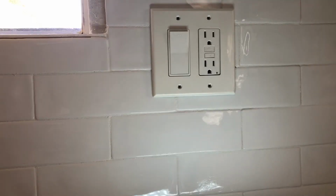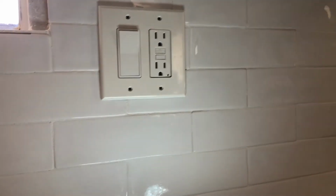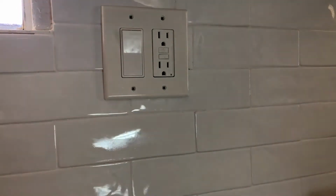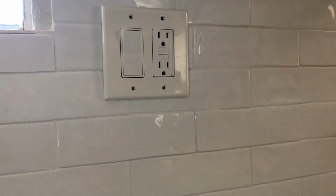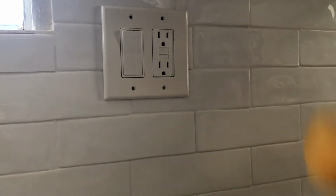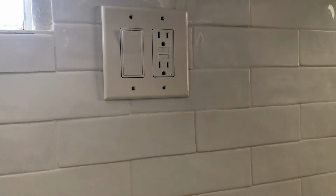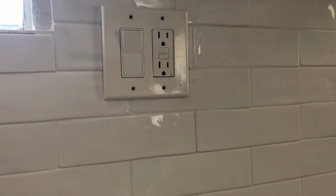This is where I grouted that side of the wall to the right side of the kitchen sink. I did that with my fingers. Now I'm trying to wipe the excess grout off the tile. I see some areas where I have to go back over, of course, because I didn't use a trowel. Like I said, that thing hurts my arm, trying to push that grout into the stone there. Anyway, I see a little part over there by the switch, which I'll fix.